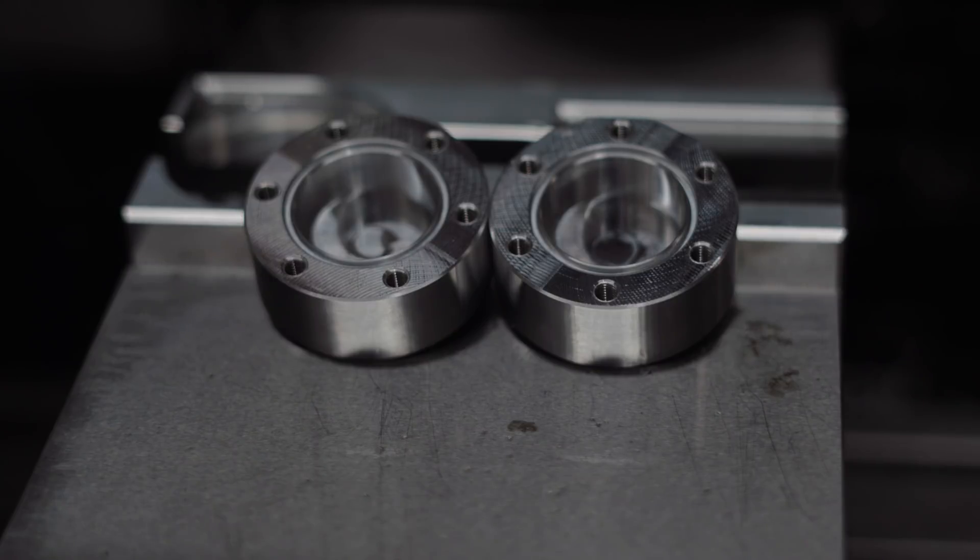I thought it might have been a controller or my G-code, but it turned out to be servo settings. Working with the Skyfire forum — shout out to Jason, Jean, and TripleTree for figuring this out — we basically tuned up the servos. It's new settings for anybody with the Skyfire. And you can see the part on the left has got a very smooth shape to it, exactly what we wanted: a nice smooth arc where there's an arc. Overall the rest of the part is identical.